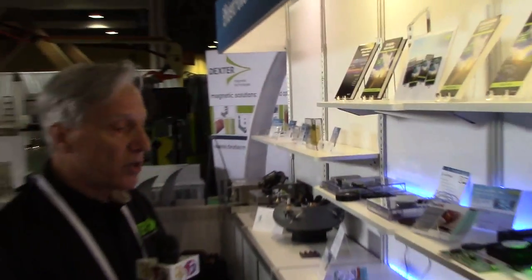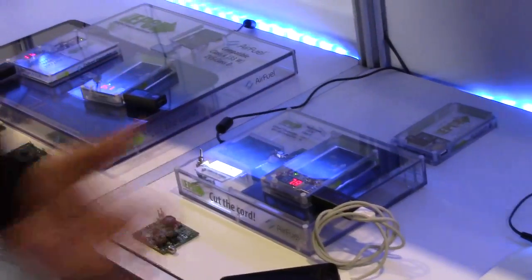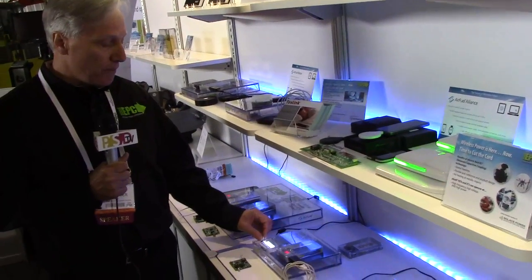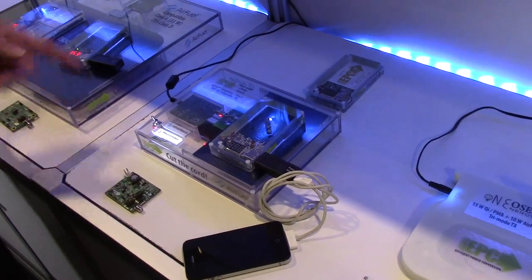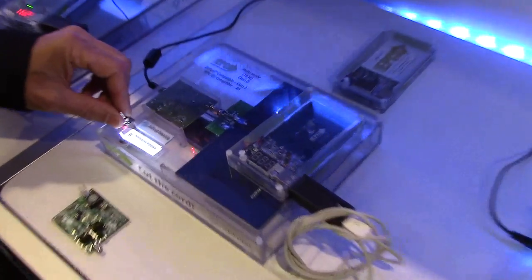Now, we also took this concept and built special amplifiers for multi-mode, because we can do all the modes with one amplifier, because GaN is fast enough to switch back and forth and do them all. So you can see this demonstration has both AirFuel, and we can turn it on to wireless power using Qi and PMA. We need to have a different board for that, but it'll do all of them through this one simple amplifier.